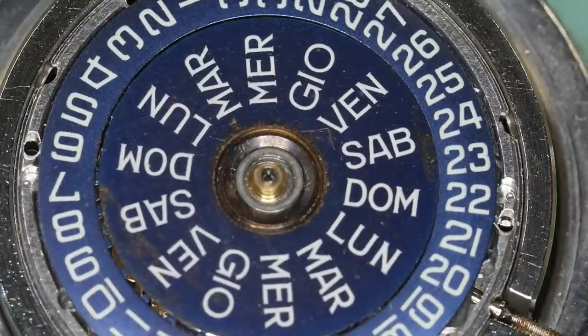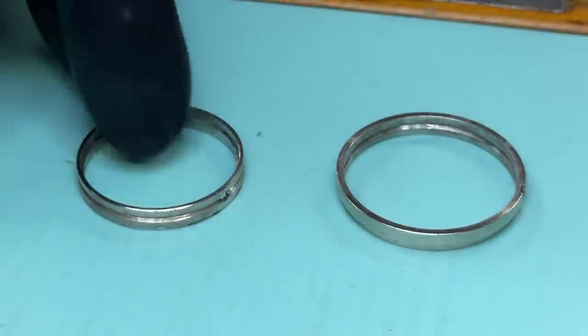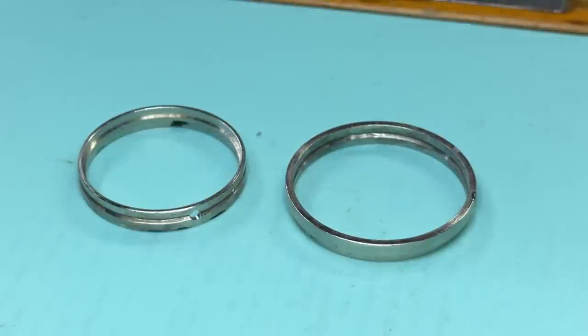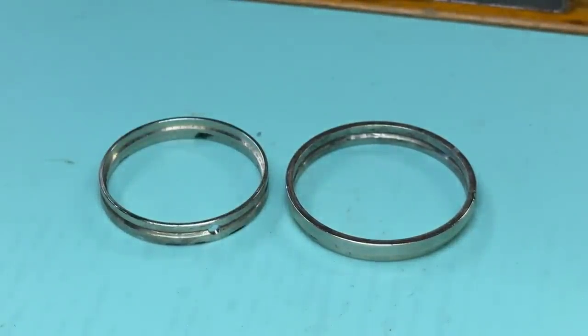It's been a right old struggle, probably not one of the best builds I've done, but enjoyable. It's always a learning curve. And remember those rings that I was pretty sure were two? Well, they definitely are. A lot of alcohol in the ultrasonic on a hot wash managed to get rid of that old gasket, so I can still now use these and put the dial up.